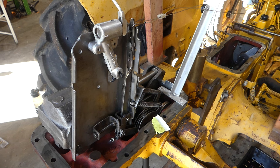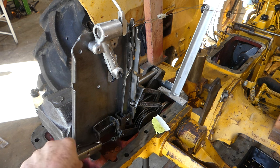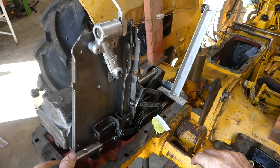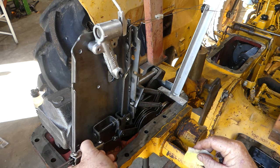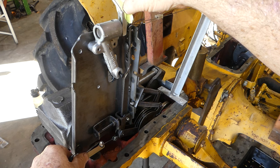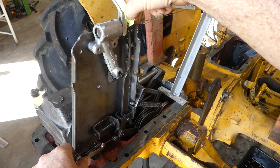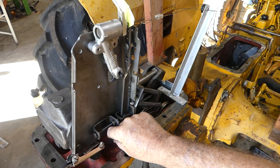It's the same story but this time we have to move this little one. We'll bring this in, take up the slack — you can see this is starting to move backwards now. The exact same adjustment. We get our little piece of paper here — that's just too tight, won't slide in. Yeah, that's a good adjustment. We hold that there and tighten the lock nut up.